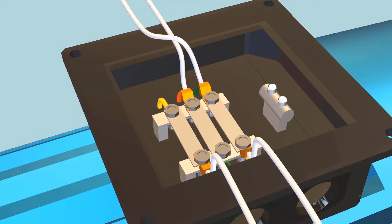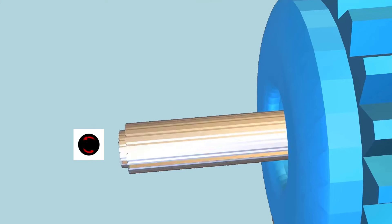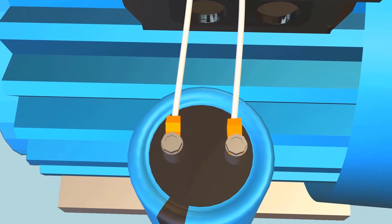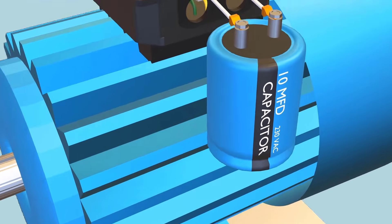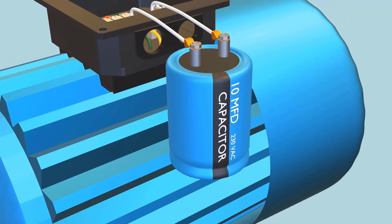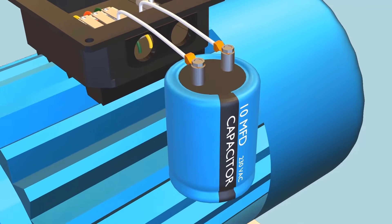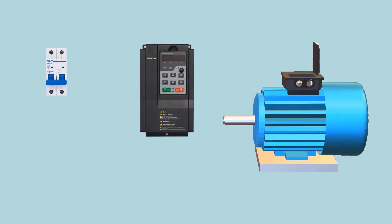As you can see, the motor now starts running in the counterclockwise direction. Let's understand the limitations of this method. The output of the three-phase induction motor is reduced to two-thirds of full load power. This method can only be used for temporary purposes — it's not suitable for continuous running applications. The loading effect on two phases will also reduce the lifespan of the motor.